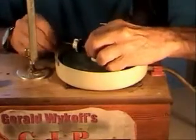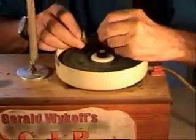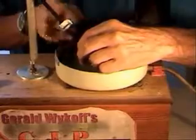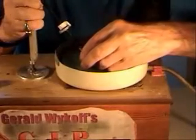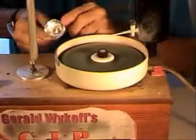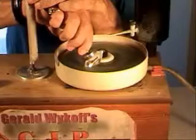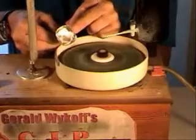Here we have the trigger and the index gear — a 32 gear — which is set right now so that we can do one of the star-down angles. We drop way up here, turn the motor on, get a little water going, and then because it's so large, it's a two-handed operation. That's cutting nice and flat. You can hear the facet going flat to the lap, the polishing lap. Perfect. That's finished — very nicely, that's finished.